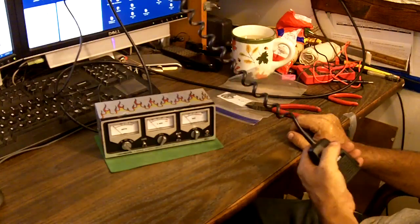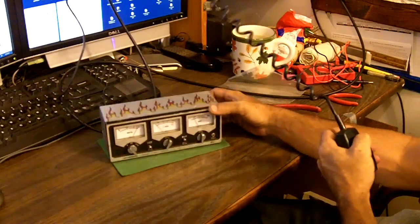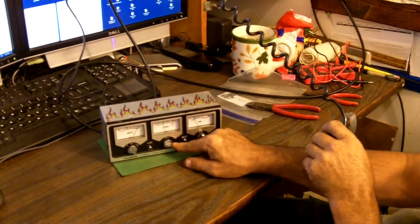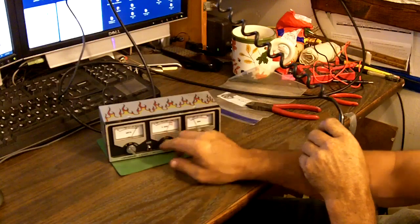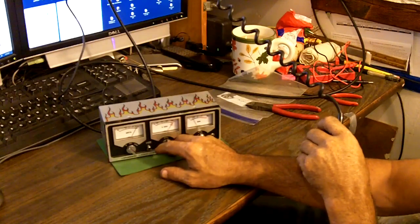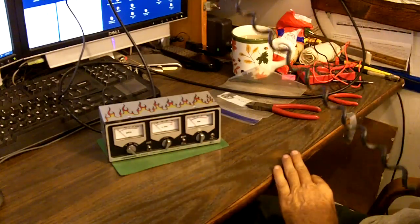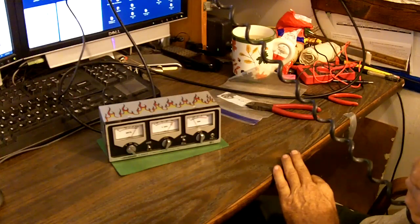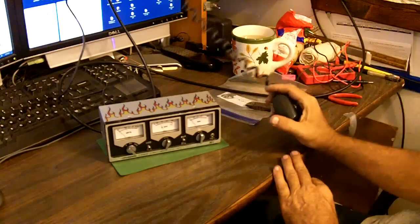I put the radio back on AM. Look at that. The watt meter works fine. The SWR meter works fine. The only one I didn't check yet is the modulation. There's no noise in the room right now, so just checking the modulation on this old Washington. Look at that. Well over 100%. There we go. Nice. All right. Sorry to bother anybody. Broadcasting.